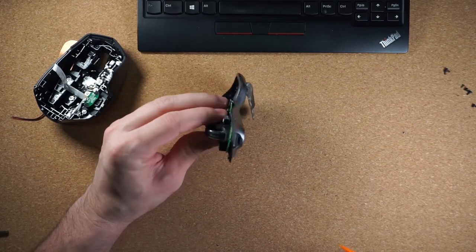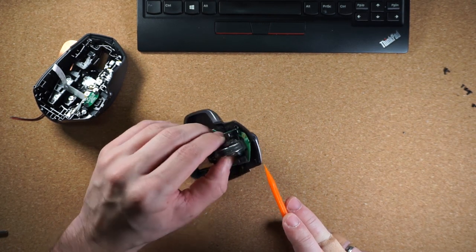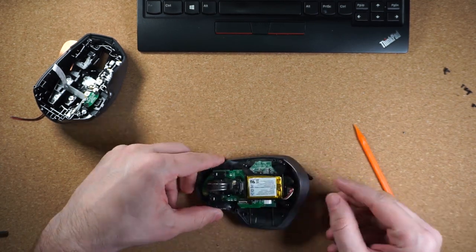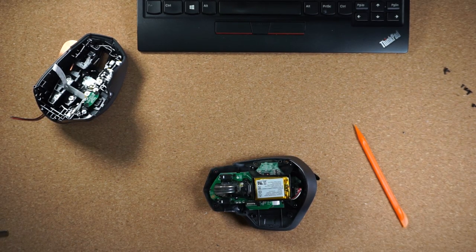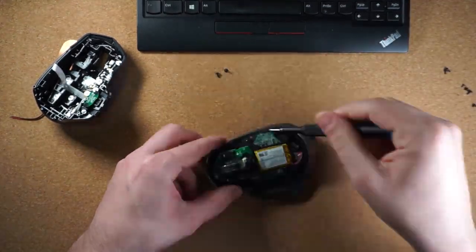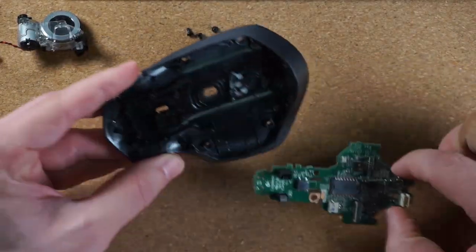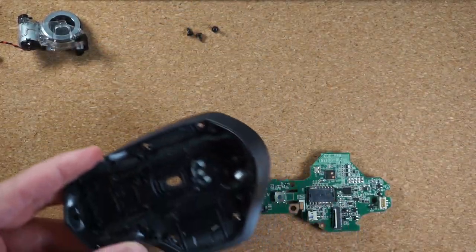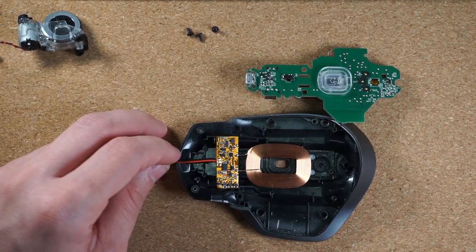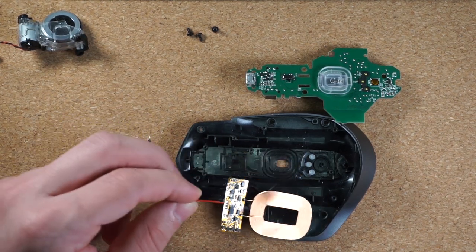Let's take a look at what's inside. One way to connect our receiver coil is to solder positive and negative leads directly to the USB connector, which is this little guy right here. We need to take out this board and take a closer look at it. We are going to remove everything in our way until we have access to this micro USB connector. Let's see where we can solder positive and negative terminal and also where we can place our receiver coil. Ideally we would want to place it in this area, but the coil is too large and won't fit without modification.